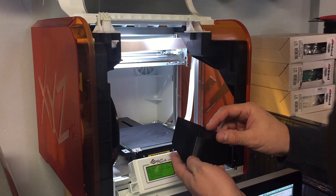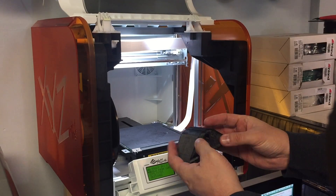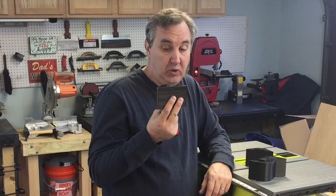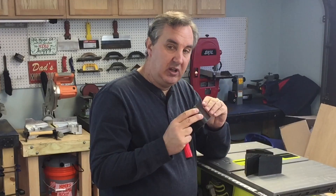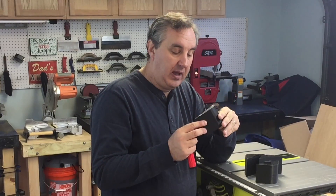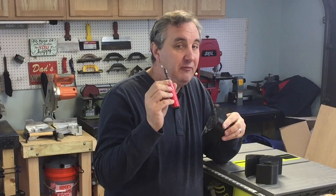The first one I printed didn't have the triangular locator on top, but the quality was really good so I planned to print them all on that machine. However, I ran out of plastic and have to use their proprietary plastic, so I printed one more on the Junior and the rest on my Reflashed Repetier DaVinci 1.0a. The DaVinci Junior prints are actually a little better in some respects — no splitting and very solid — though the ABS prints off the 1.0a have a smoother finish. I printed with a raft on the 1.0a so I need to clean the bottom using a finishing tool I've shown in previous videos, available through a link in the description.